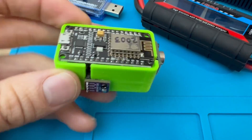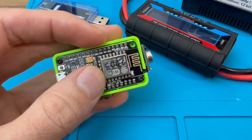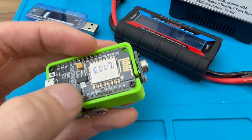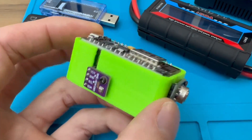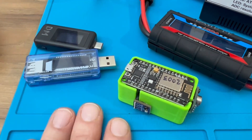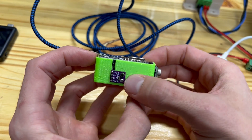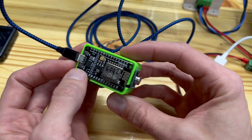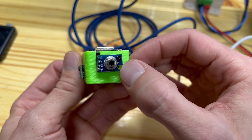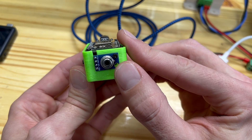When you're starting your mechatronics or electronics project, you'll usually have a microcontroller with some sensors or actuators plugged into it. Each of these has power consumption information on their data sheet, but there are several good reasons to do the testing directly anyway. It's a good idea to plug your sensors into the interface that will actually support them when you're measuring power, and measure them in real time when calling functions that utilize the sensors, like this infrared temperature sensor.